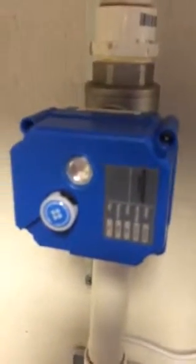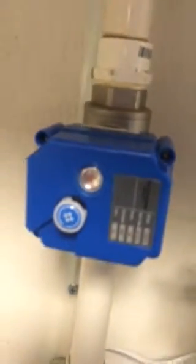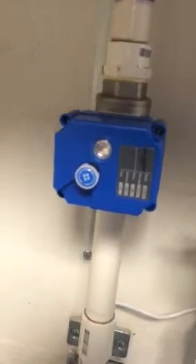This will save you lots of problems with a water leak, say from your washing machine hoses that might have burst. You can see on this valve there's a red line in the sight glass. That red line indicates the position of the valve — right now the line is going in the same direction as the piping, meaning it's open. When closed, that red line will turn to the left, going opposite the direction of the piping.